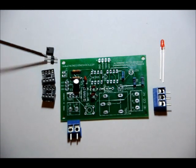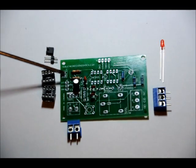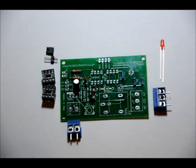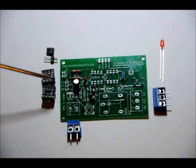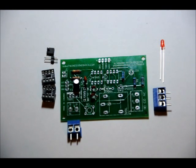Your 2-pin header goes in right here, labeled 555_EN for 555 enable. If you do not have that pin header connecting those two pins in normal operation, you have to place an external 35 to 50 kilohertz signal to drive the ultrasonic transmitter. We're not going to talk about that. That's touched upon slightly in the other video.